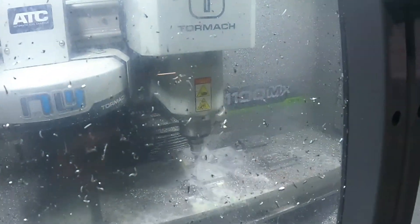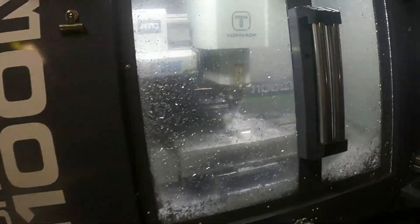The mill is just struggling through this stainless. I've spent the last two evenings working on recipes. I got some new cutters in Friday and was excited to try them. I made some really good progress, but at a third of the manufacturer's recommended feed rate, I kept losing corners and my roughing end mills started glowing and then, boom, you're done. So to get these orders out that I have right now, I'm nursing through some old torn-up four-flute half-inch end mills. I'm not going to go over brands yet because maybe some of this is my fault.